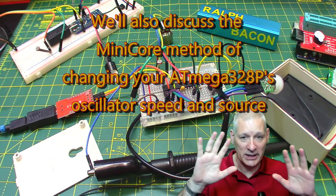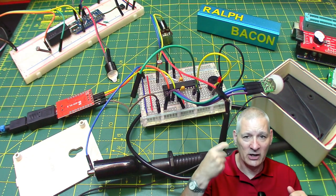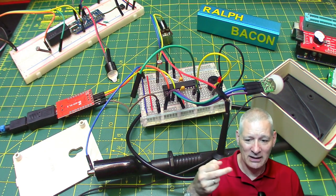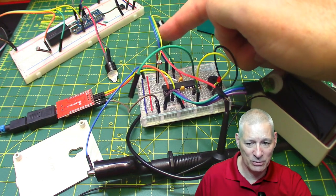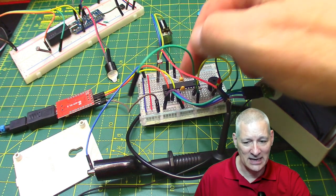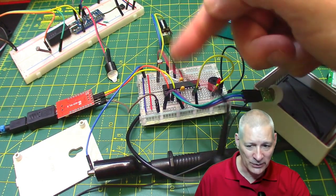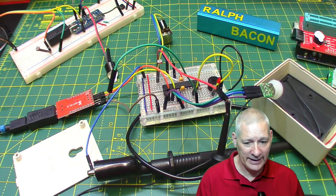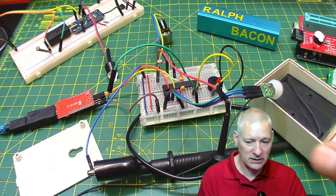So as a beginner project, I think this is probably a good one. You learn about deep sleep, you learn about interrupts, you learn about how to minimize power, even though it's not just deep sleep, it's other things like that variable resistor, and LDR is actually powered from that chip, remember, when the chip wakes up, so we don't waste power by having power running through that all the time. It's a nice little project to do, and it will run from batteries.